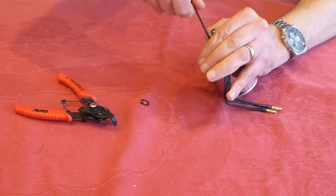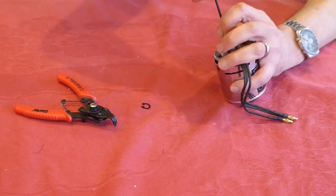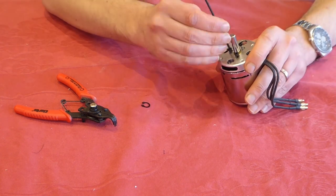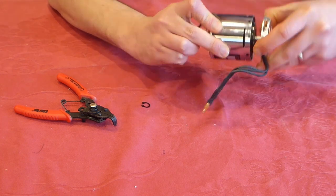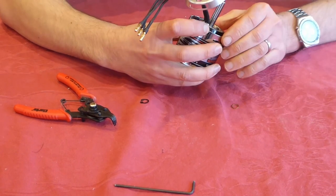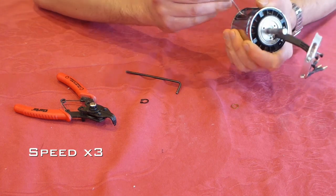I really hope all this effort will be worth it. Remember, the full size aircraft is powered by a PT6 turboprop — a jet engine that turns a large variable pitch propeller — and that's what gives the aircraft its amazing performance. Hopefully this large brushless motor running at constant RPM on a governor will sound quite realistic too.